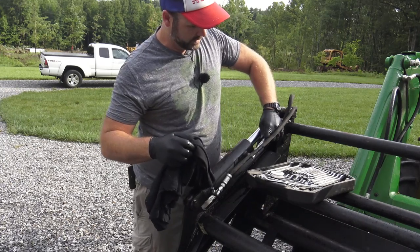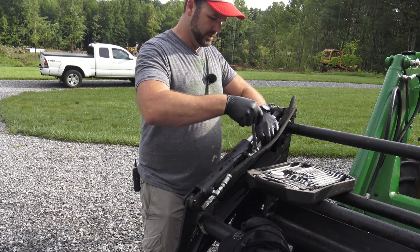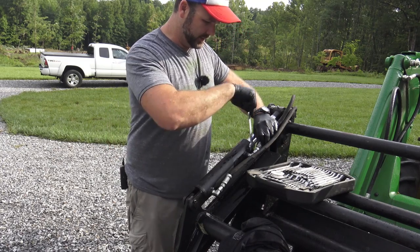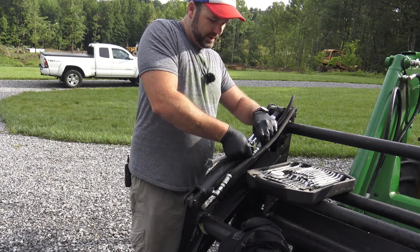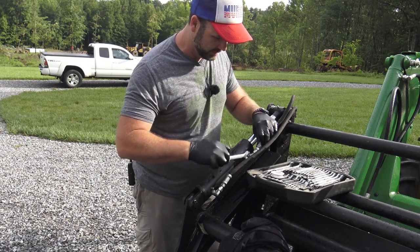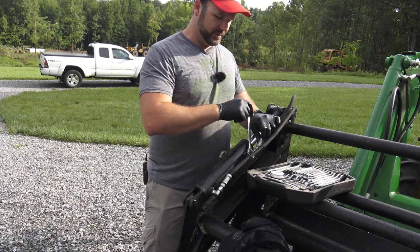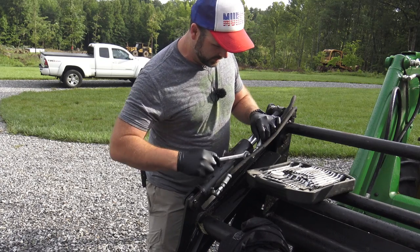Rad. Go ahead and get our line back on. Get the right angle on here. Snug this guy down, and then snug down our set nut. I wouldn't call it a set screw, I'd call it a set nut. The situation was it started leaking. Evidently that rubber seal broke, and I just didn't take the time to see what it was. I was out working with the machine and I just needed to tighten it up. So squeezing that rubber seal even tighter didn't do any good. Just got to do it right.